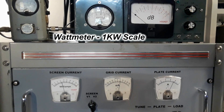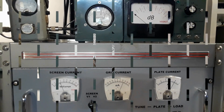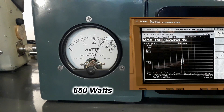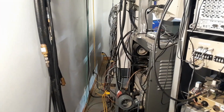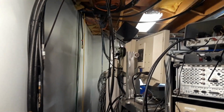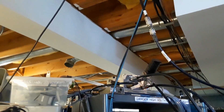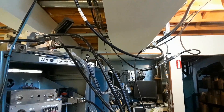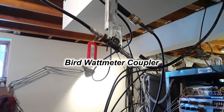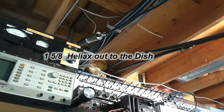So it's a bit of a juggling act, playing with the plate tune, the antenna load, and the grid circuit, back and forth, until we get there where I kind of want it. The RF comes out of the back of the amplifier there just by the exhaust fan, cooling fan, and slowly goes up the cables up to the roof and over one beam of the house. If you're wondering what the fiberglass insulation is all about, it's soundproofing, which goes both ways - my noise going upstairs, and the noise upstairs coming down here. The cable winds up connecting to the Bird RF wattmeter pickup coupler, and from there carries on with some superflex over to the main line that goes outside, which is the 1 and 5/8 inch heliax.